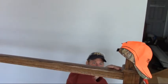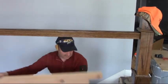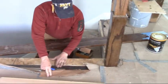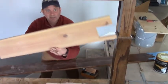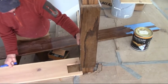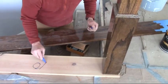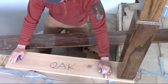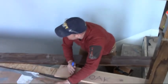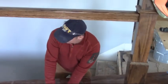So we're doing a railing. Before we left on the last day, I had Henry Ringdahl help put up this piece of handrail right here, so it is completely level left to right. I made a little template like this because I need a board to cover this and make it look nice. I took a piece of 1x8 pine as my template — pine is super cheap and I don't want to mess up this piece of oak. So I made a template that slides right here underneath this newel post — that's called a newel post. If you picture this as being oak, O-A-K, it's going to be an oak board. It'll cover up this part of the flooring and go all the way to the wall. And then I can put some trim underneath on the stairway side to cover up the ugly mess on this side too.